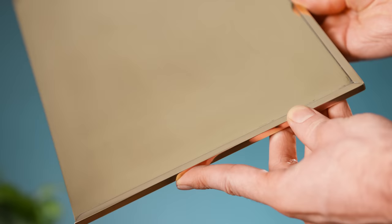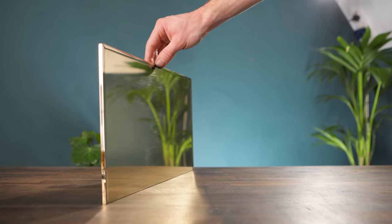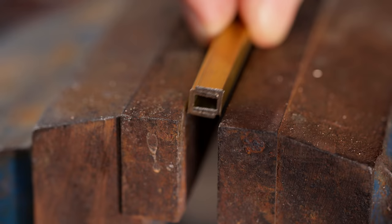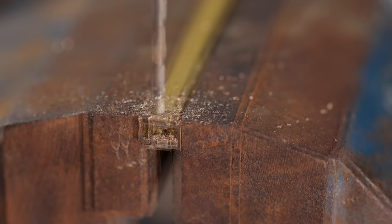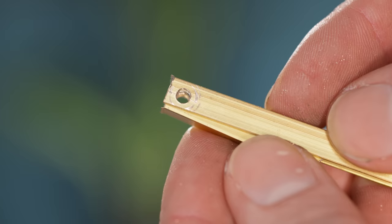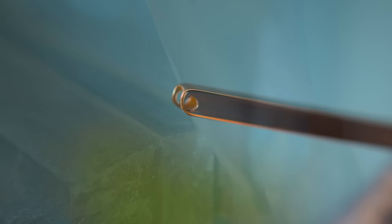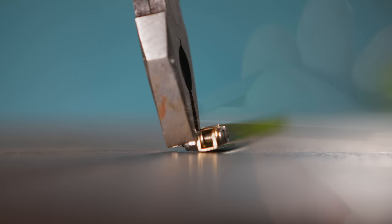The frame doesn't stand up on its own, so the next step is to work on some support legs. Brass U-channel is again perfect for this — after cutting off two pieces they can be clamped together, a pilot hole drilled through them both and widened to 3mm. These holes will have a screw through them to provide the hinge action, and their corners can be rounded off with a file to allow them to open without jamming. A locking nut shows they hinge open well to 90 degrees and are just stiff enough to support the screen.